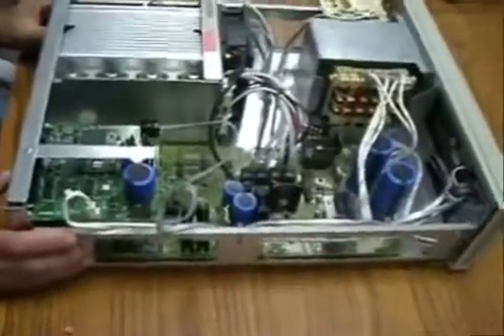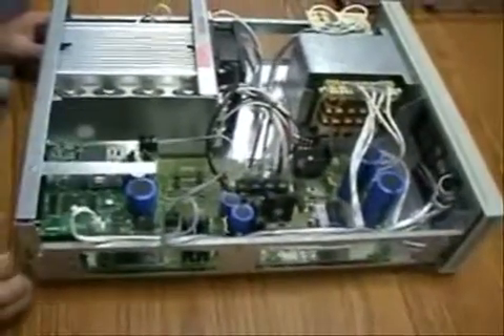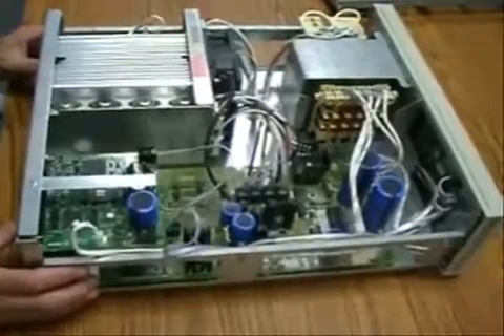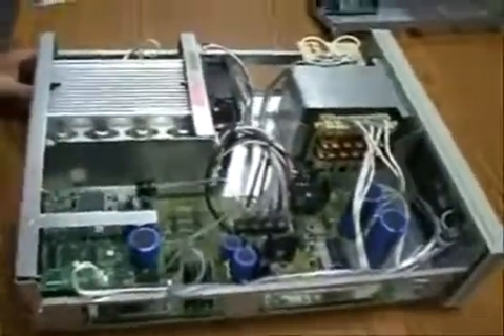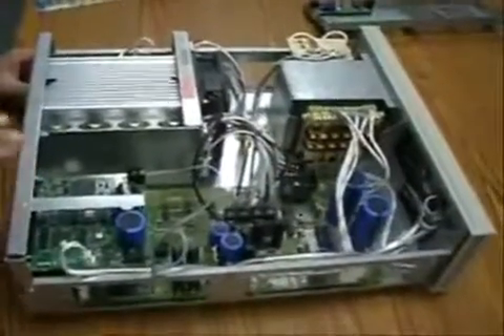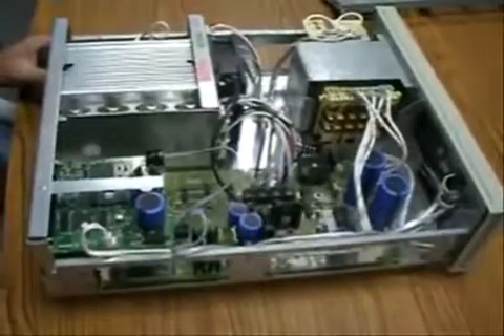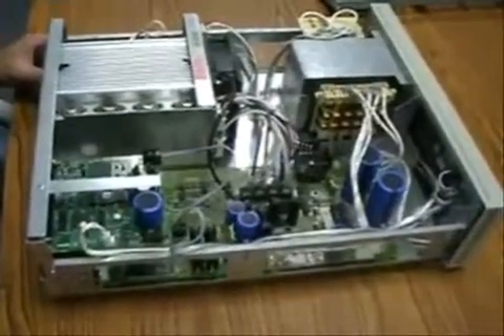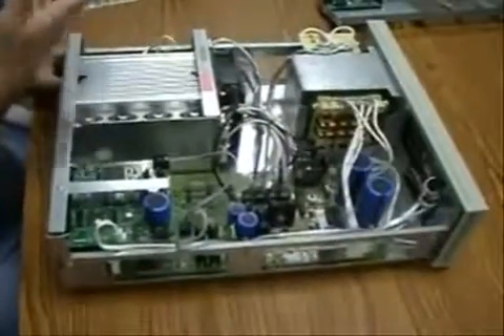In newer instruments, some of these cables may not be present — the 6950L kit will include all cables required for the retrofit. Once the GPIB board change has been made and reinstalled, it is recommended to initialize the instrument as a system unit. This change does not affect calibration constants. However, if a customer reads the model over the bus without updating it, it will still read back as the 655x series, so it is recommended that the model be changed. The nameplate should also be updated to reflect the new system model.